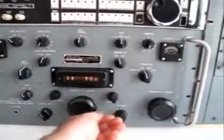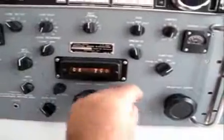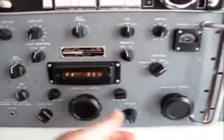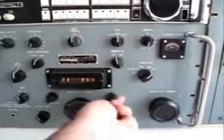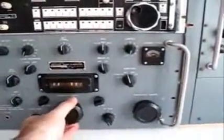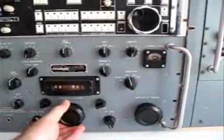What we'll do is attempt to have a bit of a listen to some of the HF stations. Let's just reset the receiver here and make sure we're actually going to be on channel. We'll look at the CAL facility and lock it off. Right, so we've now zeroed the CAL. Undo the lock, bring it back to the AGC base, and we'll just see if we can hear the Brisbane Aeronautical 867.